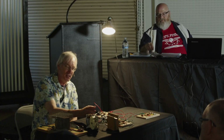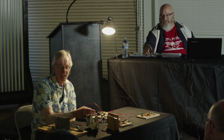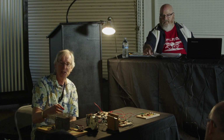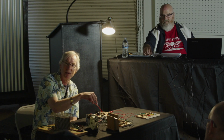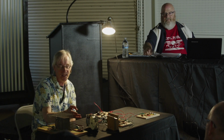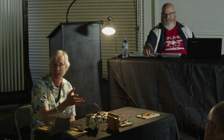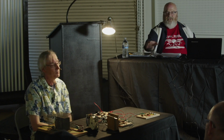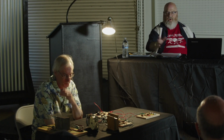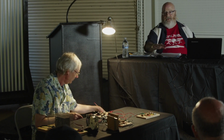So the highest digit, there's typically 3 or 4 score reels. The highest digit, there's usually not a target that will give you the 10,000 or whatever the highest digit is, and so it's borrowing a pulse from the neighbor as it carries over the 9. It's a subtly different circuit. It's an economy that they decided, we'll just share that pulse instead of giving you your own relay. We're actually going to build a carryover circuit, and when we get to it, we'll talk about the difference between the highest denomination and the others.